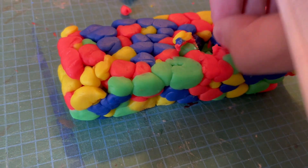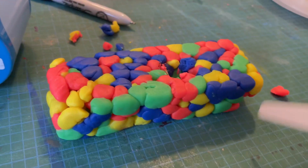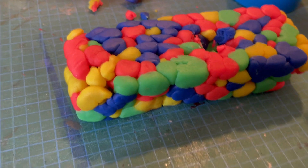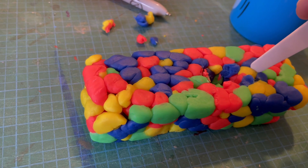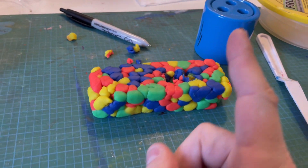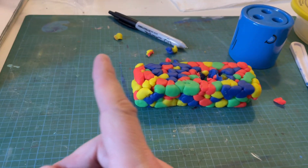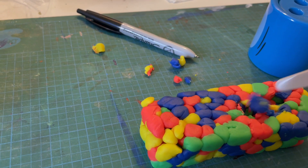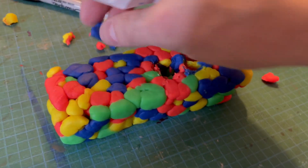Now you've gotten all these crystals that have started to get ripped out. It's now a longer range — not just one little crack anymore, but an actual longer patch the roller goes across. Remember: frequency equals one divided by the period of time. So if the period of time is increasing because the spall is growing and more of these crystals disappear, the frequency spike on your spectrum is going to start creeping down towards the lower end. The rate of speed that it travels is what we use to predict the length of time a bearing will last.